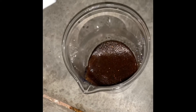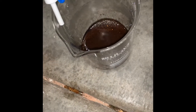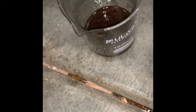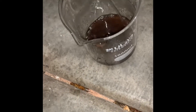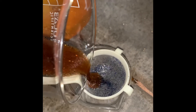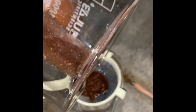The second step is to get your cation resin that's built up with sodium, and get some more DI water on it. You want to wash all the sodium that's bonded to it, and you've got to get it fluidized first before you can filter it out through your screen. Same process — just dump it through. We've got some cross-contamination in there, but it's not a concern.